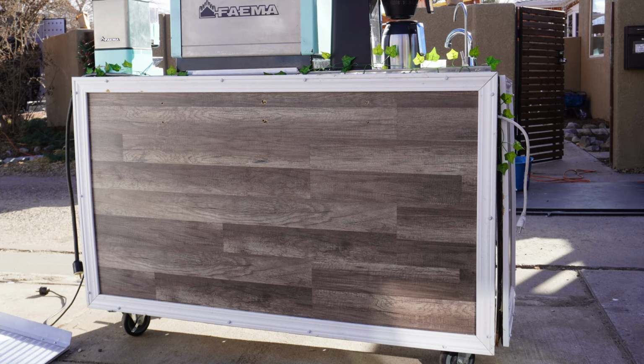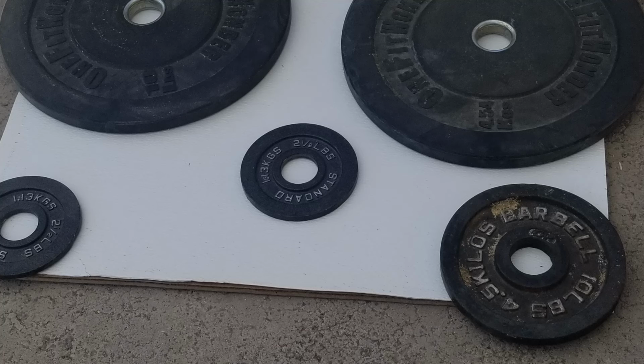Now, a side note to that is I took the cart in the trailer later on, and got a pre-inspection from my health inspector. This is where she hit me on the exposed wood. She did not like the hardboard on the inside, so I had to go back and put FRP, which is kind of like the composites you use for shower walls. So I cut the FRP and glued that to the hardboard. Then she was fine with that.